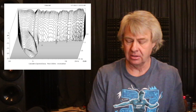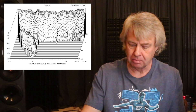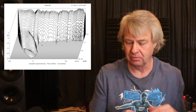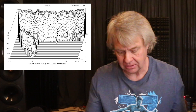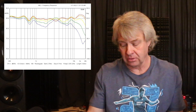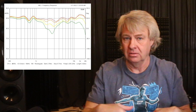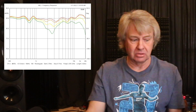Let's check out the new spectral decay. Super clean now, much cleaner than it was. A lot of that little ringiness is gone. There's still a little bit down low, which is probably indicative of not putting enough damping material in the box - if we played with that a little bit, some of that would go away. The horizontal off axis again looks good and drops off pretty evenly. In the vertical off axis, same measurements as you go up and down - not nearly the hole we had before. We're starting to see a little bit of dropout in the response, but that's because the crossover frequency is fairly high since the tweeter doesn't play down very low.